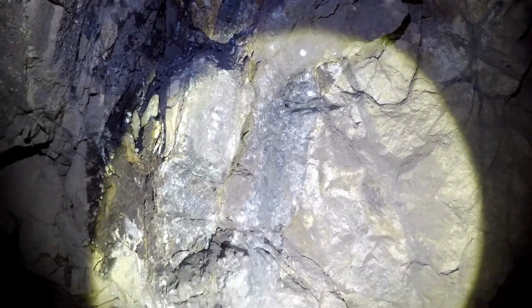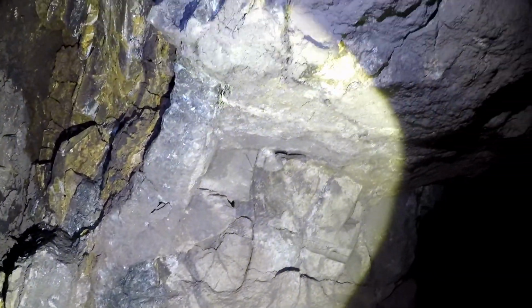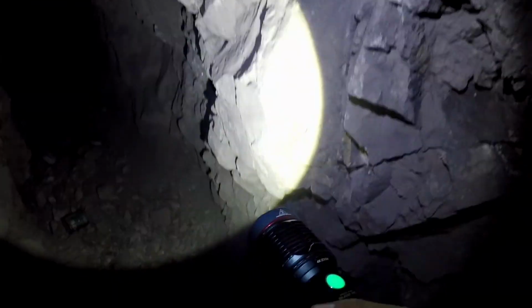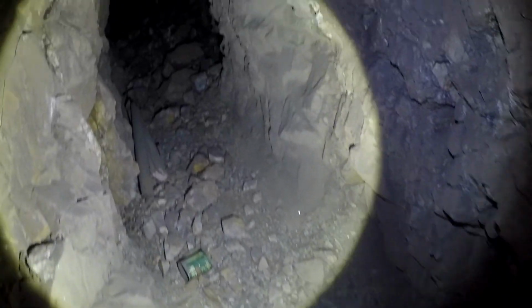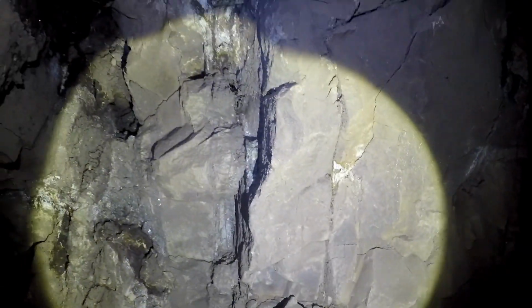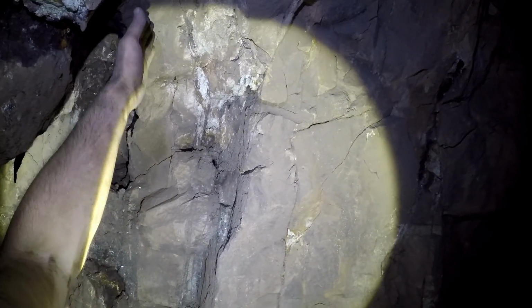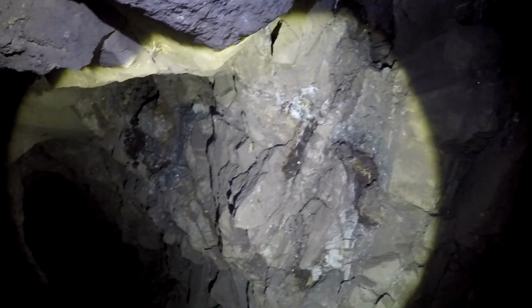More of these offshoots, so it's a sandwich. And if I can remember from my geology classes, it layered up horizontally, and then through plate action, they cleave and upheaval, and yeah, you get them going semi-vertical here. Notably, the incline of the shaft coming in pretty well matches the incline of this ore body here.